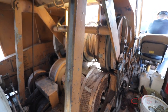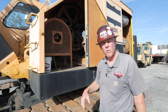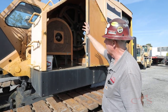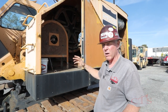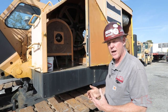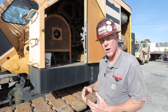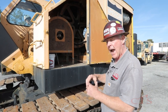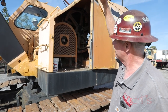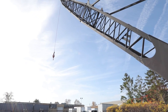My engine is directly connected to my transmission, transmission to my drawworks. Our drawworks are all engaged from our master clutch. We have our hoist drum here and we have our drives to our hoist drum. We have an inner set of brakes just like old drum brakes and an outer set. When my operator engages the hoist mechanism, the inner brakes apply and the hoist line goes up. When my operator releases, he has to hold the brake, and the outer set of brakes work. I'm going to tell my operator to hoist - he's hoisting up, and he holds the brakes.